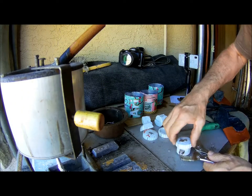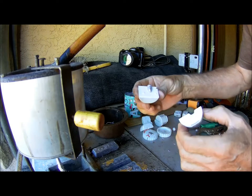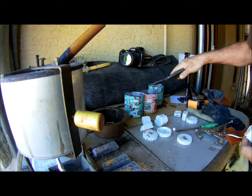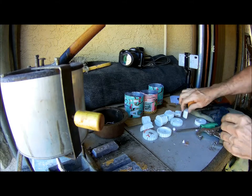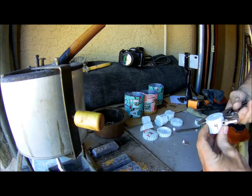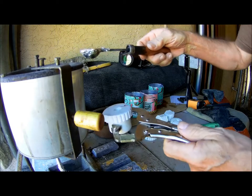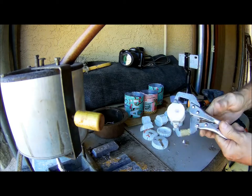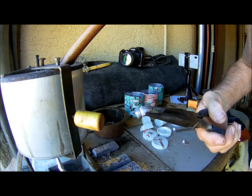I forgot to put my glove on. Come on baby, come out of there - slight pucker. That's a usable bullet. I got some flashing on the bottom, but I can still use that. I'm saying that reservedly because I have yet to measure the dimensions - I'm just going by the surface finish and the complete fill out of the bullets. If I put my calipers on there and find they're out of dimension, I can go back to my CAD software and compensate. This is mold number four - the one with three additional scoops of porcelain. Nice - that's a good usable bullet, assuming it's the correct dimensions.